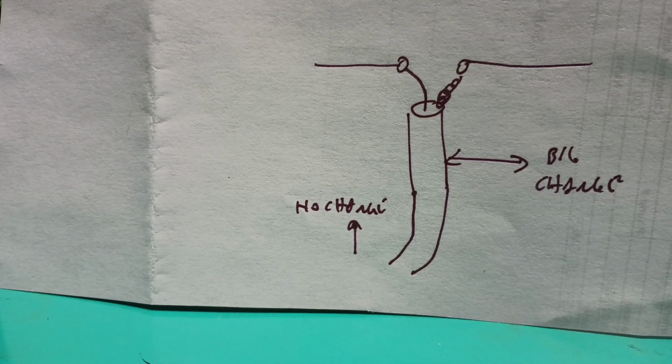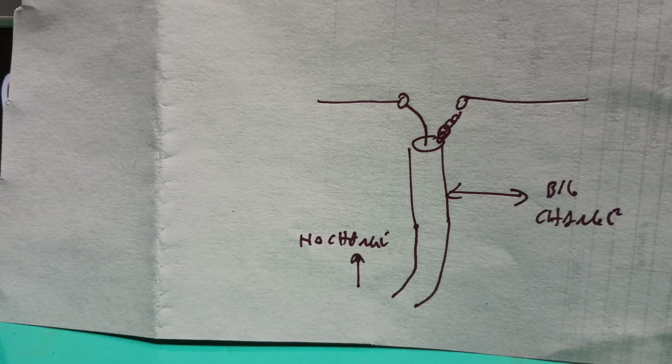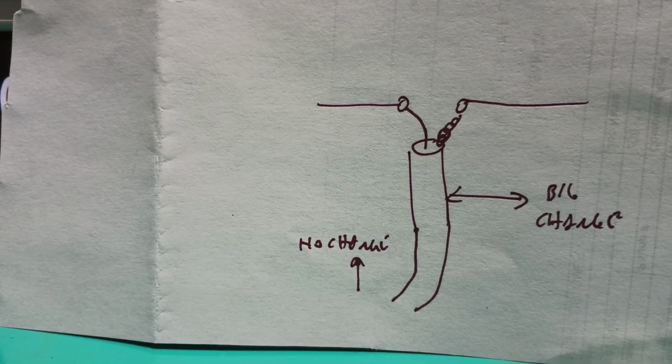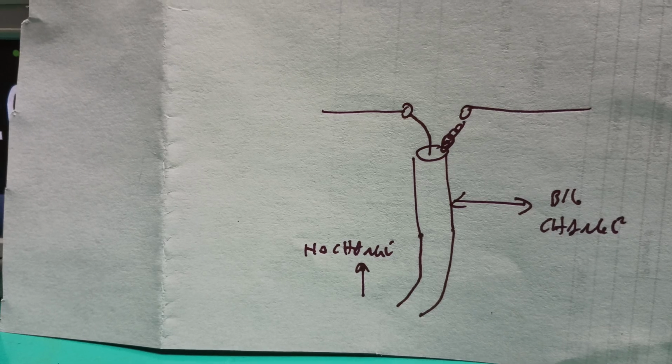Moving the bottom of the line near the ground doesn't do anything. Moving the top does, and that shows there's coupling between that wire on the left at the circle and the dipole wire taking off to the left. There's field coupling between that and the shield.